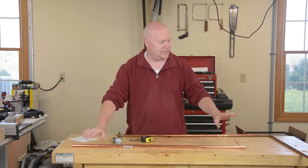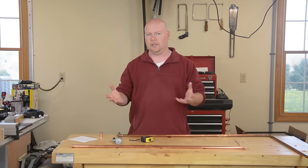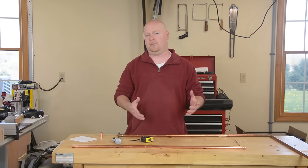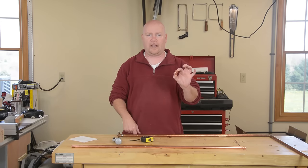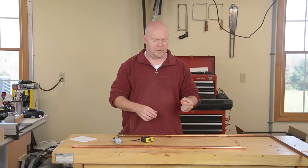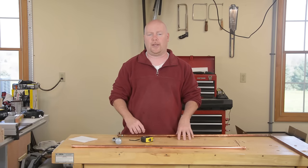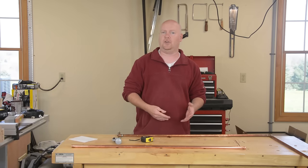The good news is that I have lots of choices in this scrap to come up with the little bit less than 50 centimeters that I need for the quarter wave, but I don't have any pieces long enough to by themselves be the tall section. Not to worry — I have a coupler here, and as long as we take the length into consideration, the slightly larger diameter for this piece and a couple more solder joints isn't going to hurt a thing. Feel free to splice copper together to make the pieces if you need to.